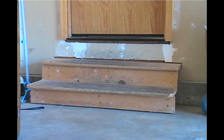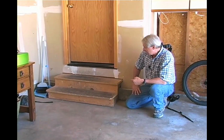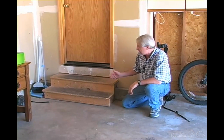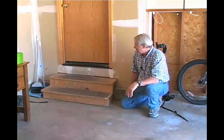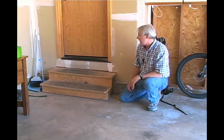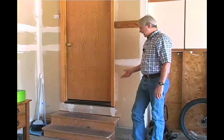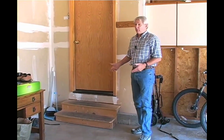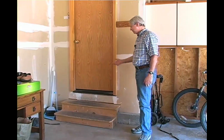In recording this as a defect, a narrative should really have 3 parts. The first part is describing the defect. So you would say that the stairs were not stable and the risers had too much variation. You should describe why that's a problem, and just that it could cause injury with somebody using the stairs. And then you should make a recommendation, and that is that it be corrected by a qualified contractor. You might want to recommend that this set of stairs have a handrail because you don't know who's going to be using it. If somebody were 85 years old or they were 3 years old, they might not be as good as everyone else at going up and down stairs, and in that case, they could use a little extra help.